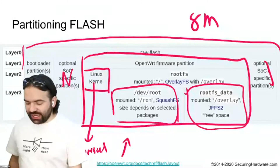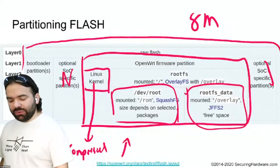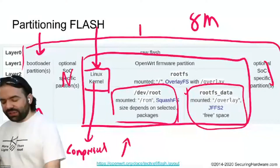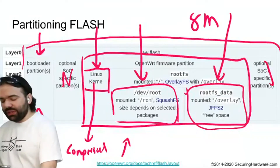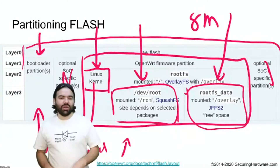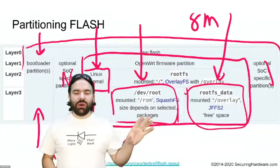We'll use a tool called binwalk. Run binwalk on our test.bin and it walks through looking for all the things that look like files. It found: a string indicating U-Boot (a bootloader), some HTML/copyright data, a header for a MIPS Linux 3.18.36 kernel, compressed kernel data, a SquashFS filesystem, and a JFFS2 filesystem. One single command walks through the whole file and finds all these pieces, matching exactly what we expected from the documented partitioning.